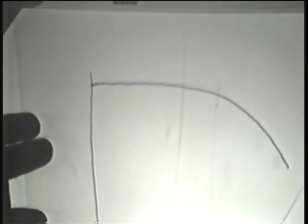On this model, the detail switch allows changing of the noise canceller circuit response to that most appropriate for high performance tape, resulting in better reproduction of fine picture details. Then it goes on to give you a diagram which is supposed to explain how that works, and it doesn't really. Very quickly, that really should be drawn. Like so.